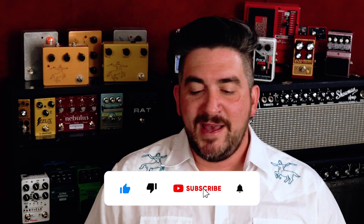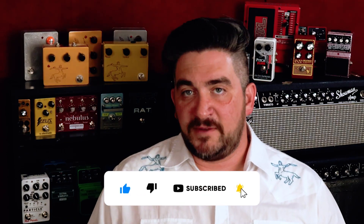Some people might ask, what if I don't want a treble boost on my Klon? Well, one, you don't have to. But two, the correct treble knob still has all the range and ability of a normal tone knob — it's just that non-filtered is about 10 or 11 o'clock instead of all the way up. If you don't want it, I'm not here to judge. But if you want your Klon Clone to sound and work like an original Klon Centaur, you want it to have a treble boost. End of story.